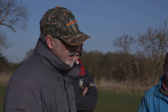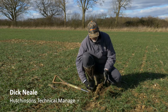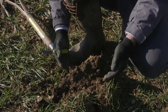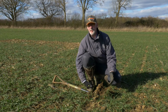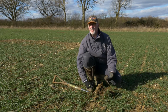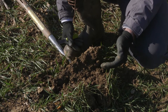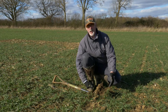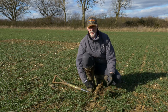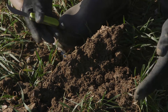This soil has a much lighter soil texture, with less clay and more silt, which makes for a much nicer working soil. This area typically uses a deep tillage cultivation system — specifically a Sumo Trio — breaking the soil down to six or eight inches. This soil works quite well because it's a nice friable type of soil.